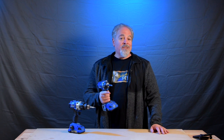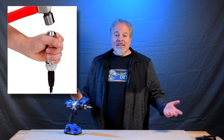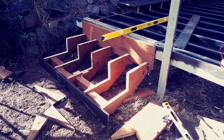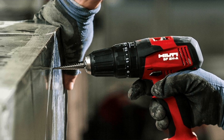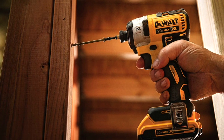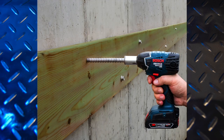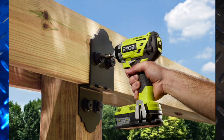This is an impact driver. There are a lot of tools with similar forms or impact in the name — hammer drill, drill driver, handheld impact driver, and impact wrench — but this tool is an impact driver and not a drill. I didn't have one until I had a large composite deck to build, but now that I do have one, it's one of my favorite tools. It doesn't replace a drill driver when it comes to drilling precise holes. Instead, impact drivers are designed for quickly and efficiently performing jobs like driving long deck screws, lag screws, structural screws, fastening concrete screw anchors, nut setting and driving screws into metal studs, and driving carriage bolts into wooden posts.